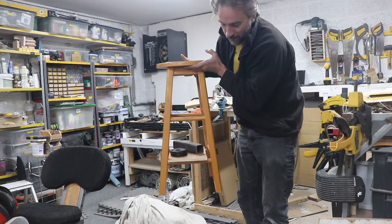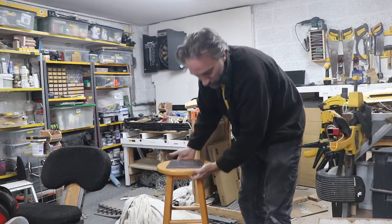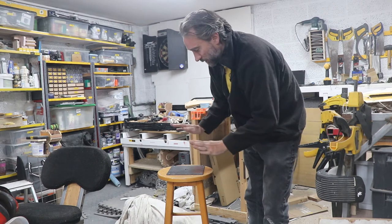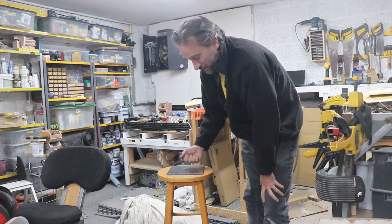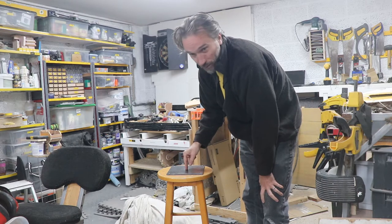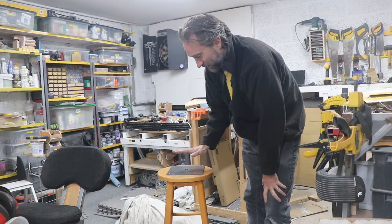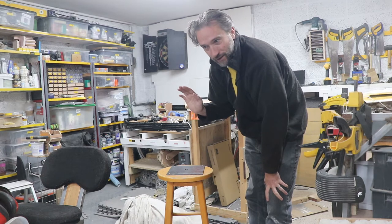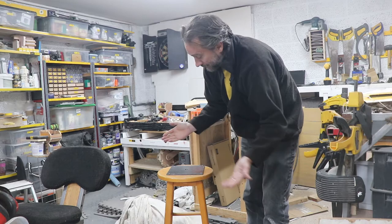I have a little wooden plate across just at the moment with some weights on it, so I should be able to make enough weight to make it stable whilst also being able to move it around. This saves me a tonne of work. First challenge: get the pin in here and keep it square and vertical whilst welding, because having this surface flat to the plate at the bottom of the crane is going to be pretty important.